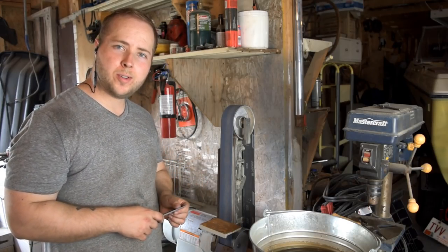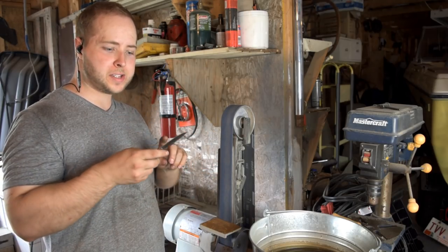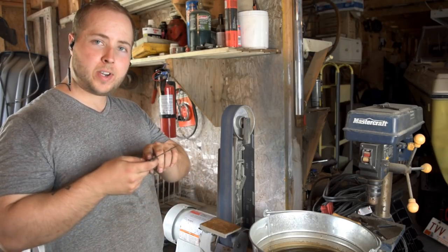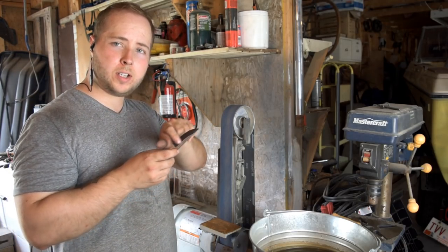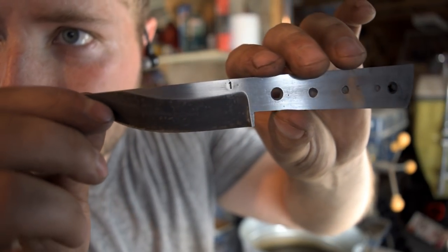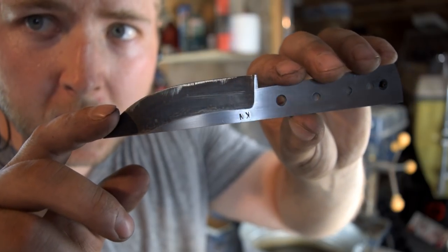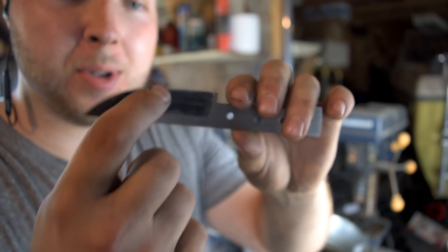Now we're to the most intimidating and most skillful part of the entire process: finish grinding these bevels. Once I do these, that's the last time these would be touched until the knife is possibly restored in 10-15 years. We've got to grind those bevels, keep on those flat planes, not interrupt our stamps, not change or raise the grind line, and most importantly not overheat these bevels. Because they're getting pretty thin, it doesn't take much to pull a blue — you'll see a burst of blue come out by your edge, and then you've overheated it and compromised the heat treat.